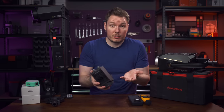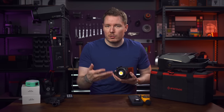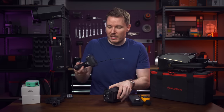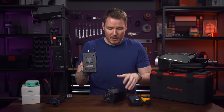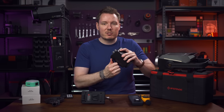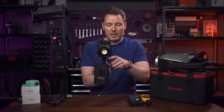The interface is very simple — just two knobs, a screen, power button, and two different power sources: a DC plug and USB-C. With the DC plug, there's a power adapter in the carrying case for mains power. There are also iFootage accessories that use that same DC plug, like a V-mount handle with a little spigot on top. You loosen off the yoke — which is metal and pretty strong — slide it onto the spigot, lock it down, slot a V-mount battery in the front, and you've got a portable 60-watt light. It uses a Mini Bowens mount, with an adapter provided for regular-size Bowens modifiers.